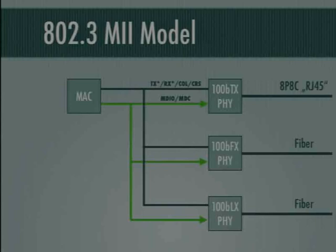Leading up to another switch chip, I want to quickly explain how PHYs normally work, because we're going to get into a discussion where we found that our model in the tree does not work like we want it for the switch chip. So the idea is that the Ethernet card has the transmit and receive logic in a media independent interface form. So you actually don't have to deal with the specifics of how the bits are actually encoded on the actual transmission medium. And they thought, well, we come up with a system where it can actually have multiple ones on a single interface, because you might want to be able to switch between them, or it's cheaper to manufacture a single card that can hook up to multiple things.